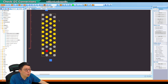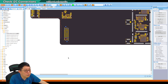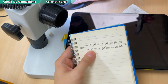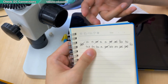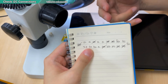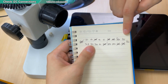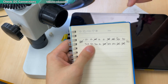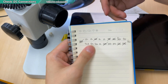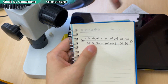Because you don't know which one, this is where I do the hard work. I have already measured the flex from the camera connector one by one — which one goes to where — and I end up with this data. Maybe some of you are fixing the same problem, so this might be useful. This is the front camera connector and all the values I get. I2C runs in a pair — the data and the clock — and I believe some of the audience already know this.